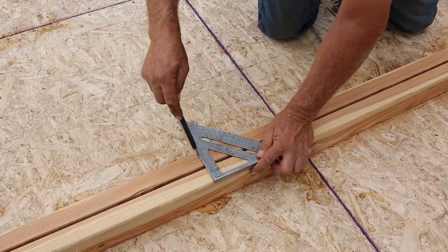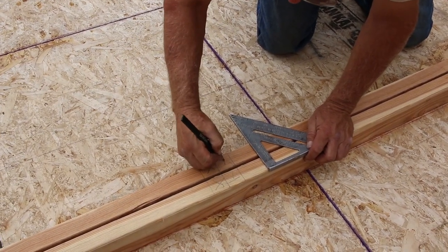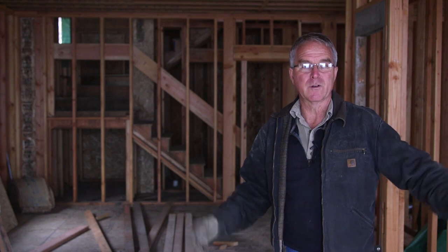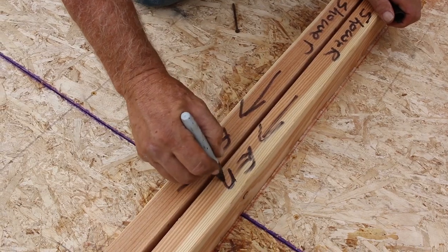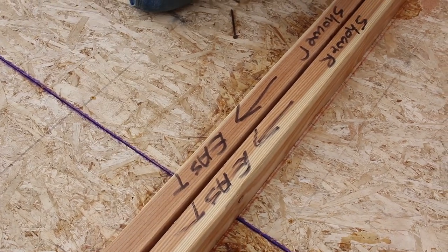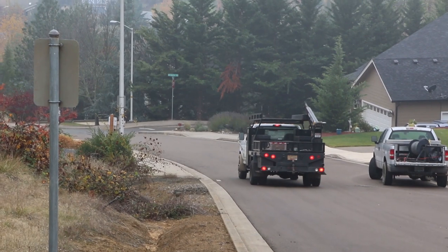To wrap this up: there's a world of information you can put on a set of wall plates. After all the special conditions are put in, you put the common layout in — whether it's 2-foot or 16-inch — holding back so your 4-foot sheet goods break in the middle of a stud. However much special information you have to put on those plates — stud heights, clipping the plate to drop stud height, or whatever it is — it all has to be right, because it'll take a moment to make the mark and hours to tear out the lumber if you get it in the wrong spot. Set up a situation where you can get it right. Thanks for watching Essential Craftsman and keep up the good work.